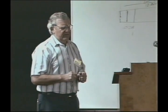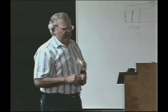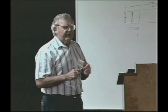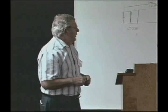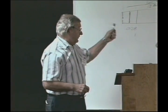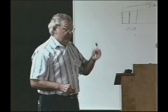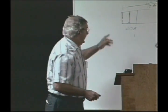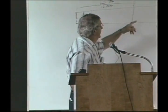I've seen guitars through the years that are horrible for intonation, and people are raving about how accurate it is and how it plays. So what we strive for in Gilbert guitars, of course, is to place the frets exactly where they should be. And we have fixtures and tools so that we place them. We generally can check. We do check as we're doing them.